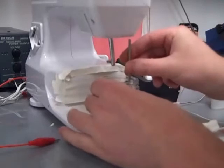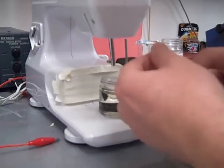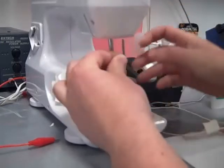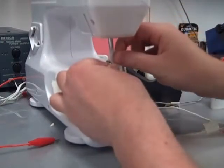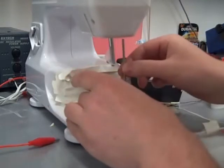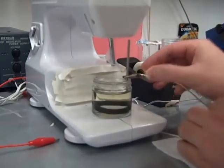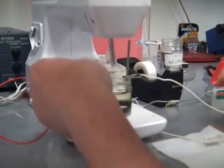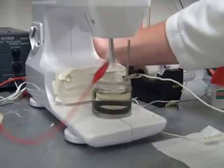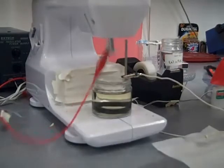The graphite ring is placed under the sewing arm, and then a thin piece of tungsten wire is taped to the sewing arm, partially immersed in solution. Leads are then applied to the graphite pole on one end and to the sewing arm on the other. Two volts are applied across the leads and the sewing machine is turned on, which dips the tungsten into solution and electrolytically sharpens it for two minutes.